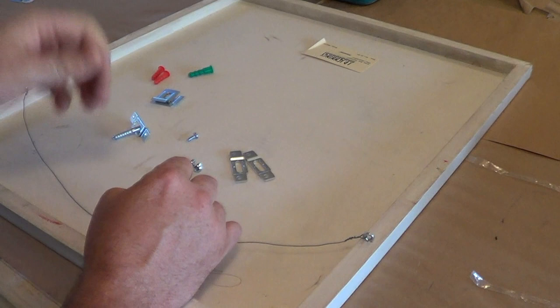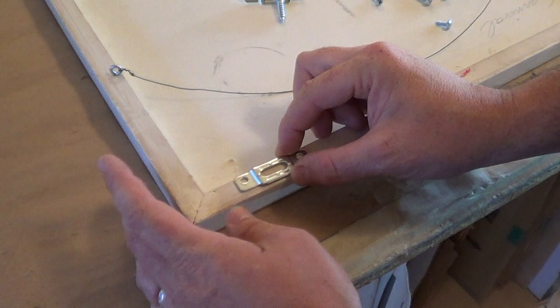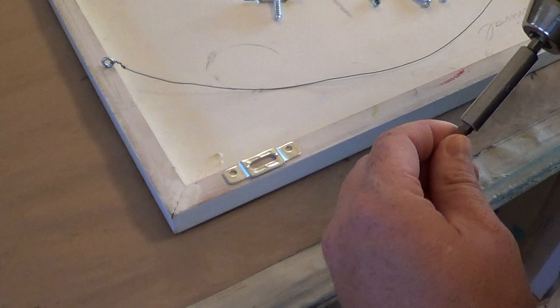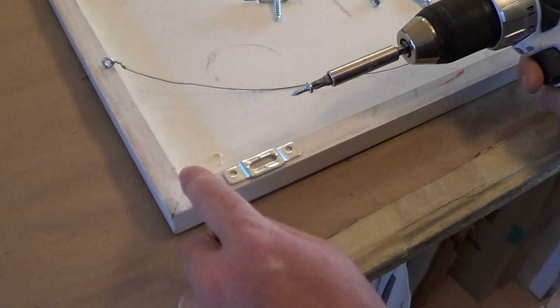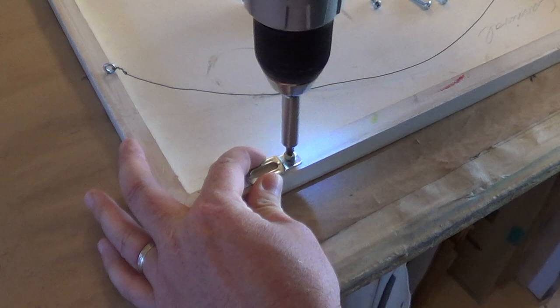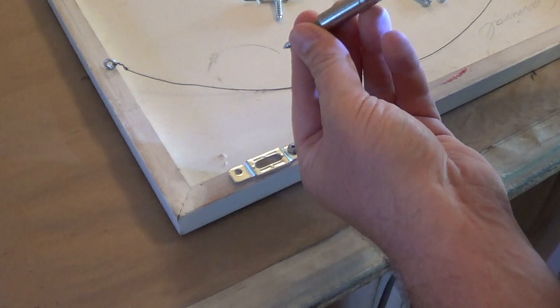You also have your miscellaneous screws. I'm going to go ahead and screw this together. When you're screwing these in, it's not critical exactly where they go — just in from the edge a little ways. You might consider pre-drilling; we'll see if it goes without pre-drilling. Just make sure you're not going to split the end of your wood. Never drive a screw right in the joint — that can pop the joint loose. But it's not rocket science; just go ahead and mount these quickly.